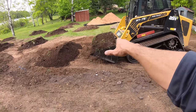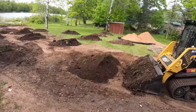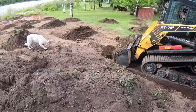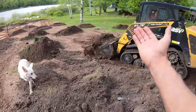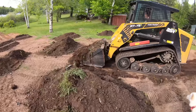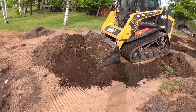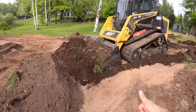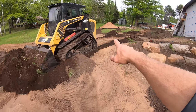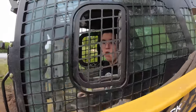Tilt your bucket forward — see, it's heavier so it moves more. Raise it up a little, then drive forward slowly. If you're gouging, you've got to watch what you're doing because when driving forward it's easy to gouge fast. You've got to follow the contours with the tip — the leading edge of your bucket. You're cutting to the subgrade. There we go — perfect. See, he didn't leave a trail behind him. Back dragging is where you begin your skills of grading.